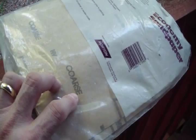But I've got some other coarse in here, but it's not as high grade. It's not industrial grade, so I might use the industrial grade just to make sure that it doesn't crack when you fold it. Sometimes this thinner stuff, the normal stuff, when you fold it around the edges and put it in one of these sanding blocks, sometimes it'll start cracking and ripping on you if you get too aggressive. But maybe I'll use the industrial grade, what they call emery cloth. And you have to sand the previous covering of laminate and get it kind of rough so it will take the glue.